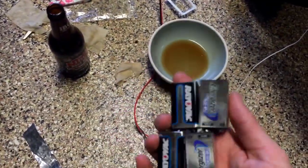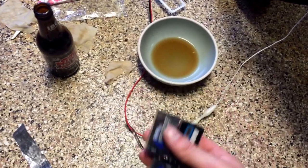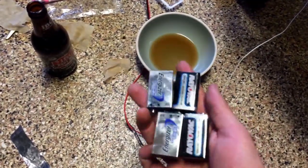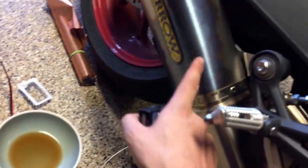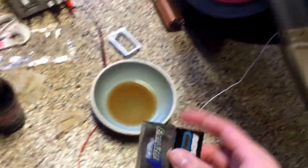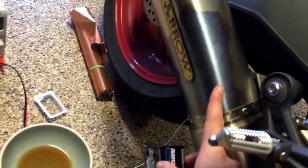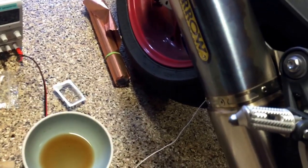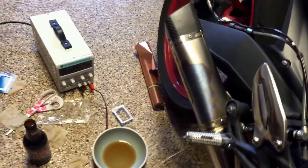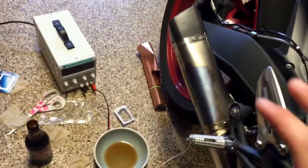You're going to use some batteries. Here I have four 9-volt batteries to give a total of about 36 volts, and that is what I used to begin with. That got me about this far, but then I switched to this DC generator because the batteries were already too low a voltage to produce this light blue color I'm looking for. With titanium, about 36 volts will give you this light blue. As you step up the voltage — add another 9 volts — the blue will come out like a purple.